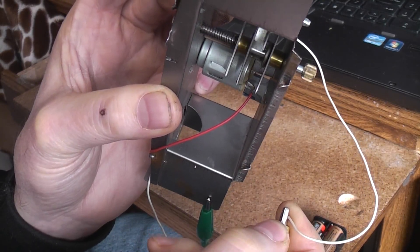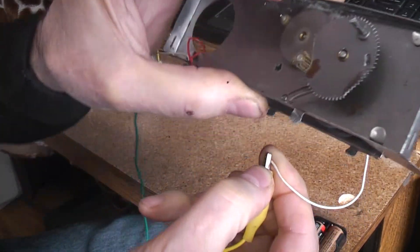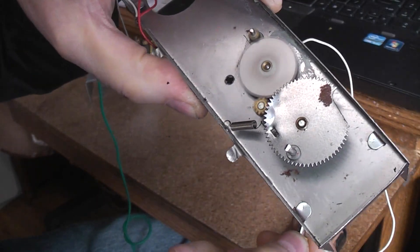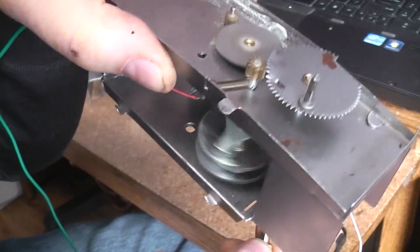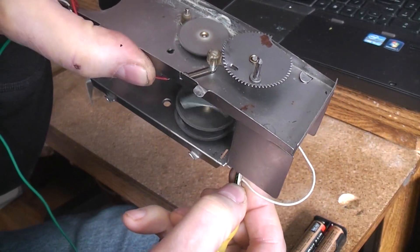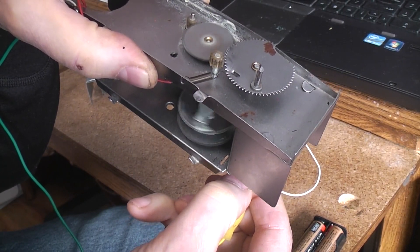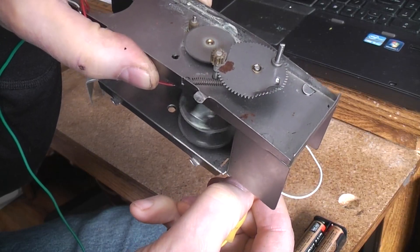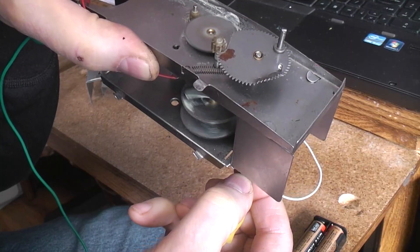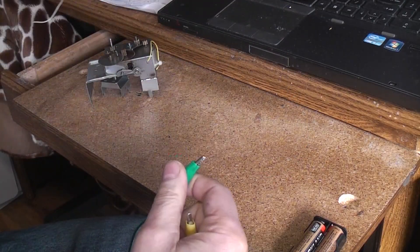This normally ran on more than three volts so it happens quicker. You can see how the gears just crawled apart. Now nothing's moving in the top because the door spring has sprung back as the gear went down. Watch as the gear comes back up and engages the mechanism again — there it comes, engaging — and it would now have opened the door and the guns would be out. That's how this particular toy used the ramp-walker mechanism.